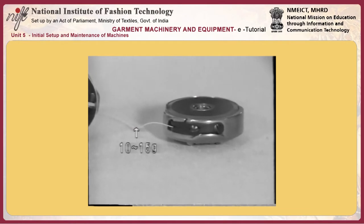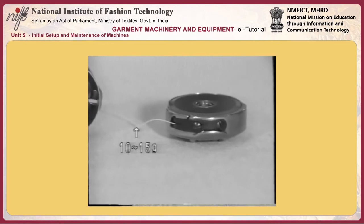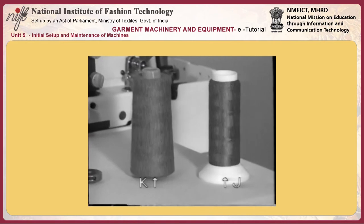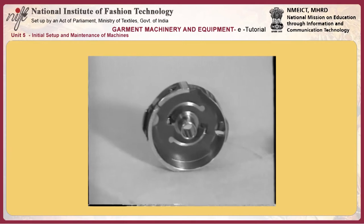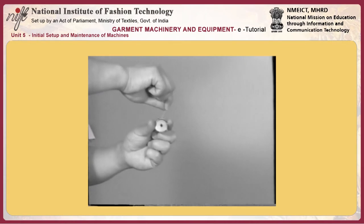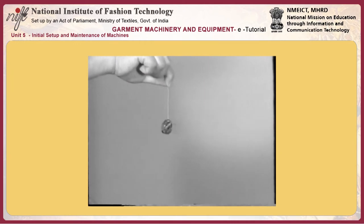15.4. Adjusting the thread tension. Adjust the needle thread tension for bar-taking sections B and E using tension controller number 1H. Adjust the thread tension for left and right side parallel sections C and D using tension controller number 2I. For both tension controllers, turn the controller clockwise to increase or counterclockwise to decrease the thread tension.